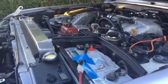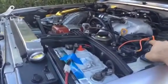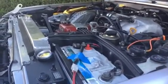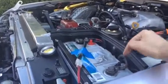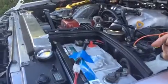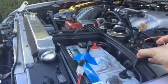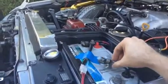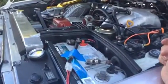Using the bypass for the positive, it did actually blow — I figured it would. So now let's see what happens when I go ahead and take the ground terminal off the truck while it's running. Same issue — no problem there with either the positive or the negative being removed.